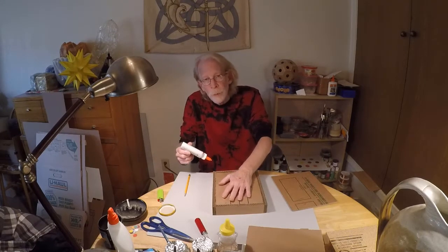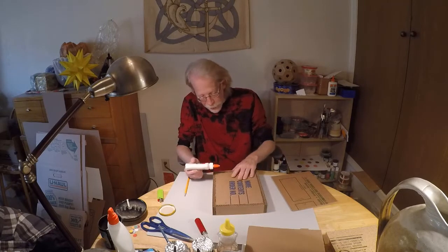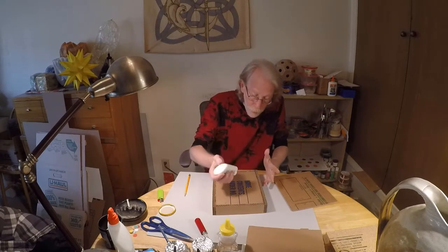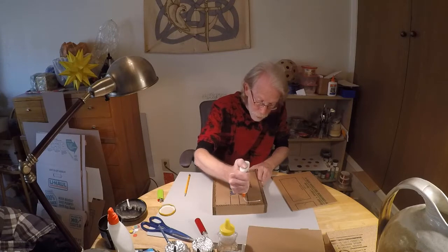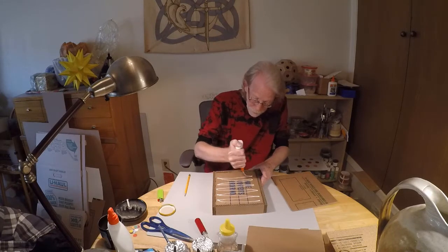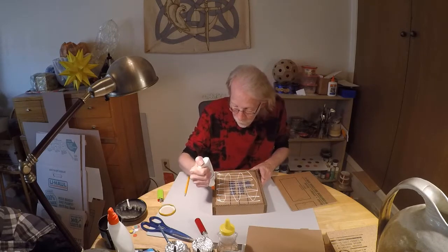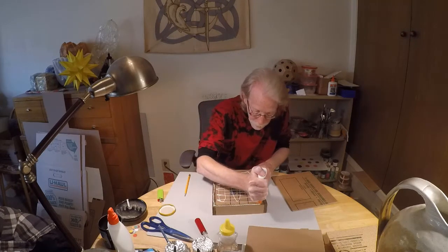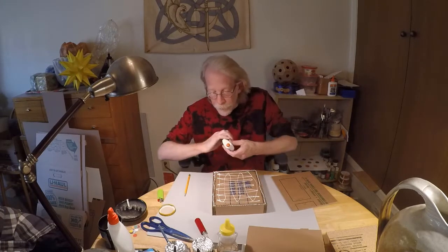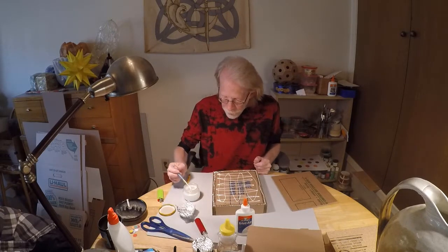Danger of this warping at all, because we've secured it basically with the sides, and they're going at a different angle, so it's all holding stable at this point. So, like with the lid, we don't need a whole lot of glue to tack this down. But we'll have more than we had on the lid. And right along here, the edge, it's important that we get enough glue. We'll have to go over this with our glue brush to make sure that there is glue connecting the edges.